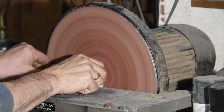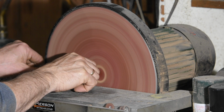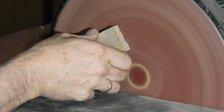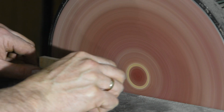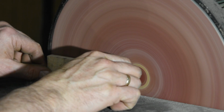Finally, as with sandpaper, if you just push in one spot on the piece, you'll tend to make things uneven, even with hard materials like steel. So I try to move my fingers around and ease up on my pressure as I get close to finishing up. The harder you press, the more you bend the part and dish out the area where you're pushing.